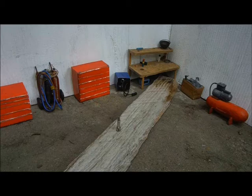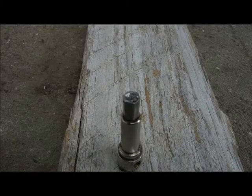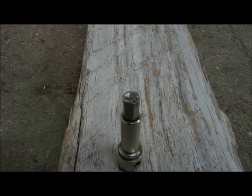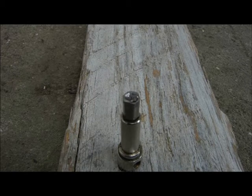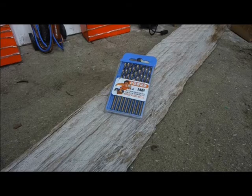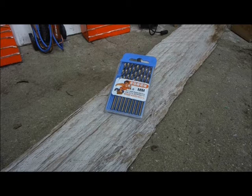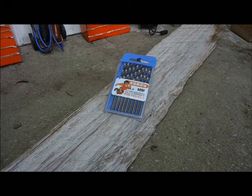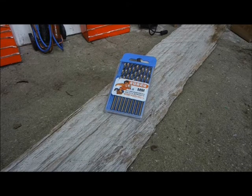However, there was one thing I failed to take into account, and that is simply that I'm drilling into a very hard piece of steel surrounded by conventional mild steel. So my 2mm drill bit wandered. In response to this disaster, I went to Amazon and I ordered no fewer than 10 cobalt 3mm drill bits. I'm going to abandon the idea of pilot drilling with a 2mm drill bit first, because it was skinny enough to flex and it wandered around.